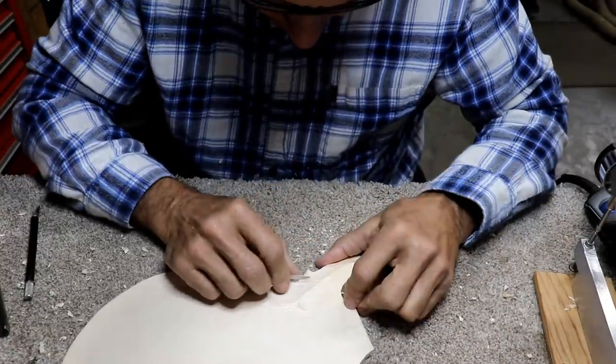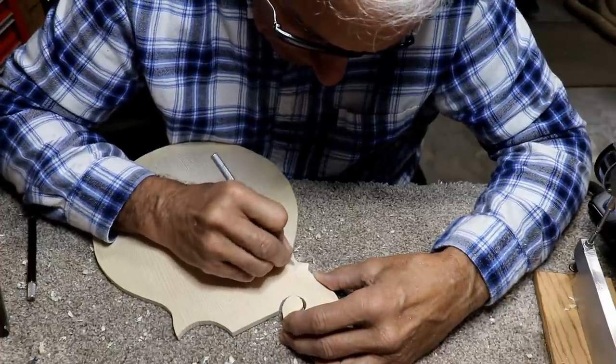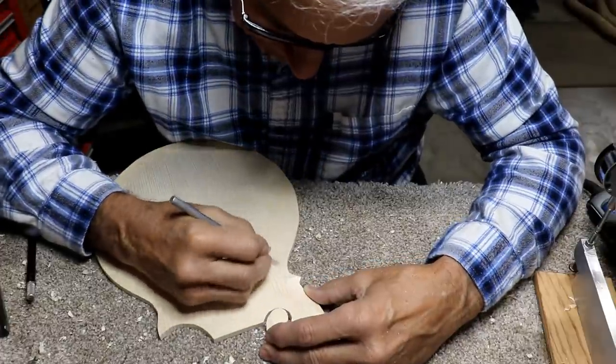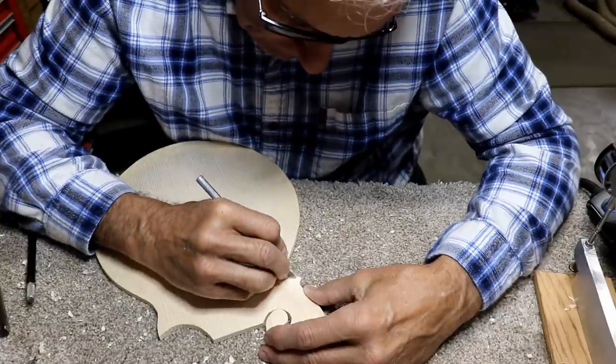Now I'll take my really sharp Exacto blade and scrape the detail back in, leveling out all these bumps. The direction you scrape makes all the difference — if you notice you're getting tear-out you have to instantly go the other way, otherwise you just make it worse. Imagine there's a lot of folks out there who don't realize how much you can carve just with a scraping action of a blade. This is looking pretty good. The softer the wood is, believe it or not, the harder it is to get perfectly smooth, because everything affects that light flimsy grain.